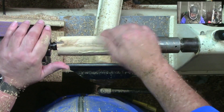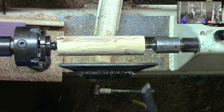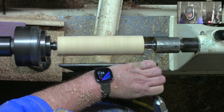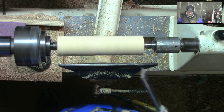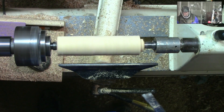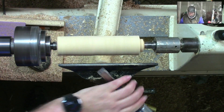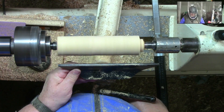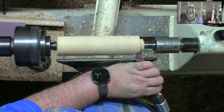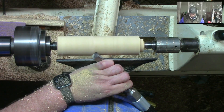Let's take a look at this — this wood is eat up with insects. So we're going to take our three-quarter inch skew and practice some end cuts, which will square off the end of a piece of wood. It's always good to practice a peeling cut because that's how we make our tenon. We can come in and do an end cut to square that off. We're going to raise our tool rest up just a little bit and see if we can do a planing cut.